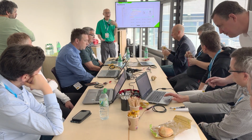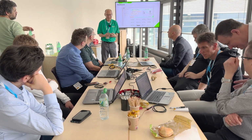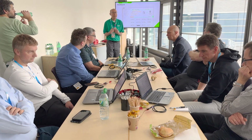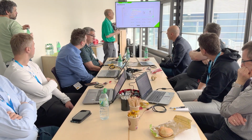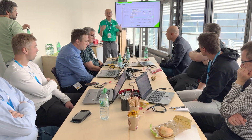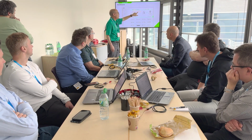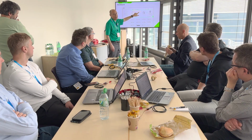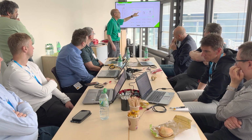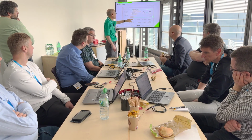Firmware updates don't happen automatically because we don't want that in the embedded world. We want control of it. But it will tell you if you are on a previous firmware, and in general, it's the right idea to update as soon as you can because there are security fixes, bug fixes, that sort of thing. This is an icon with a little cloud that says disconnected. This means that it's currently not connected to Remote Manager. It doesn't mean the device itself does not have a cellular connection. I point that out because it confuses people sometimes.